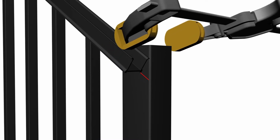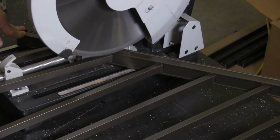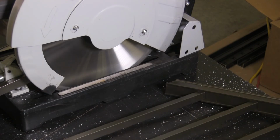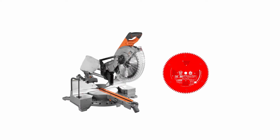Remove clamps and cut stair balustrade at all 4 locations, 2mm less than the opening size, 1mm each end. Take care to cut stair channels at appropriate stair angle. Use of miter saw with a sharp, non-ferrous blade is recommended. Cut 50mm stair posts where marked, taking care to cut at appropriate stair angle and direction.